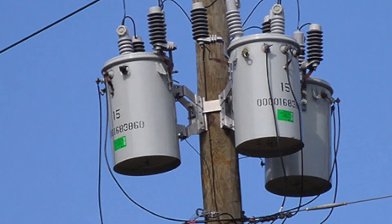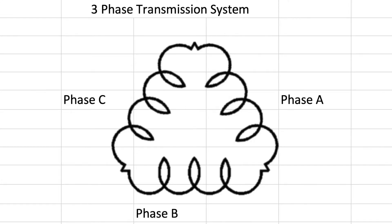If you're not familiar with the setup that we have in North America, it's called Edison 3-wire or a split-phase system. What that means is that it starts with a three-phase distribution system — three wires on every power pole, three different phases transmitted along the power grid — and then in our neighborhood it gets transformed down from 13,000 or 100,000 or 200,000 volts down into what we use in our homes, which is 120 and 240 volts.